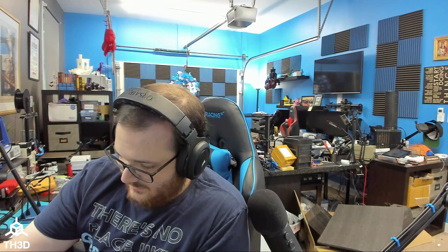So let's say 2.7 at 24 volts. I know the Ohm's law formula, I just don't do it in my head. I'm lazy. 24 volts, 2.7 ohms resistance. That's 8.8 amps, 213 watts. So I think that connector will be fine. It's pretty beefy. It feels solid.